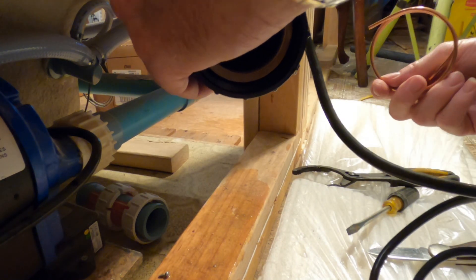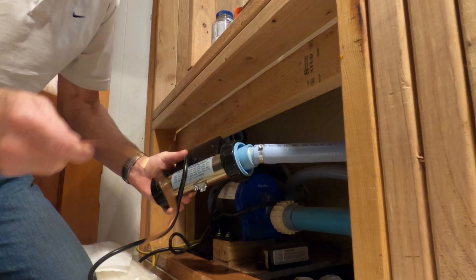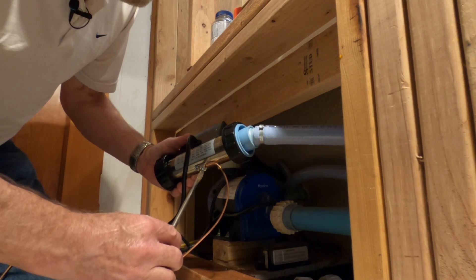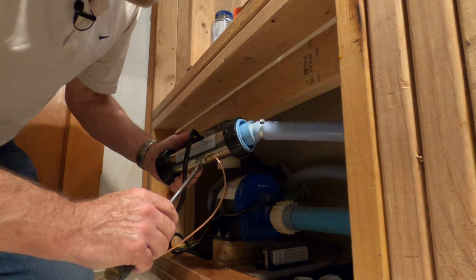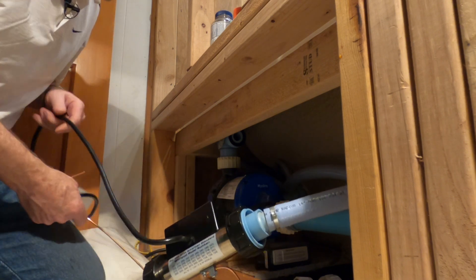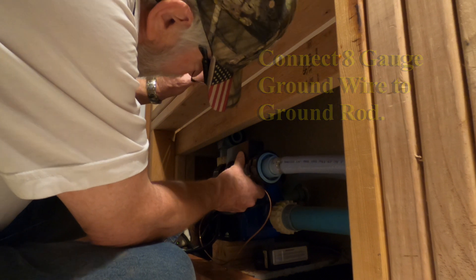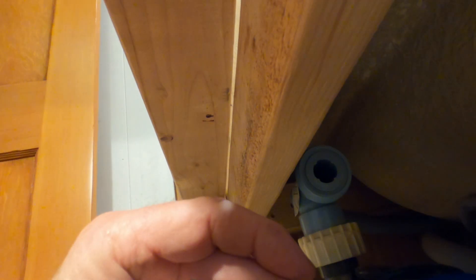Let's put the ground cable in. It's important to have ground on electrical - something going that way goes down this instead of into your unit. Got that in; I'm going to hook it to that bolt - hopefully it's the only place I can see to go. Make sure the washer's in there good.